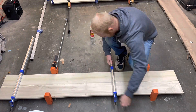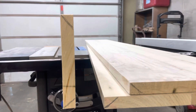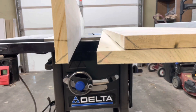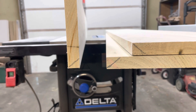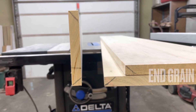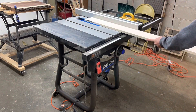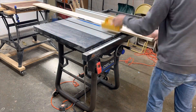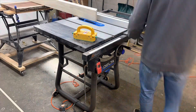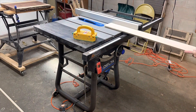With the glue up done I could turn my attention to the 45-degree cuts. This is where you could make the project more advanced or keep it simple. You could just do a classic butt joint to make the box for the mantel, but that would leave exposed end grain somewhere - either the front, sides, and or the top and bottom. With the 45-degree cuts, there will be no end grain and the grain will look continuous around the mantel.